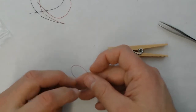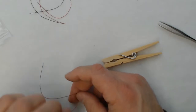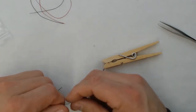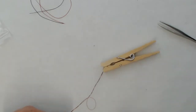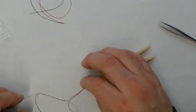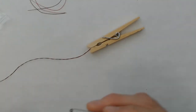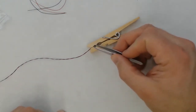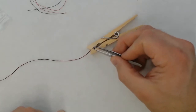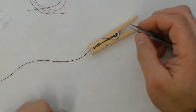And I want to prep the LED, the wired up LED here, by twisting the wires together. So now this is a pro tip that I've picked up on. If you twist the wires together into a braid, it makes the wires more manageable and allows us to bend and shape it as we need it. We'll put a dab of super glue onto the LED and put the lens and housing on there. We want to be careful to get it aligned correctly the first time, because the super glue does dry pretty quick. I think I got it.